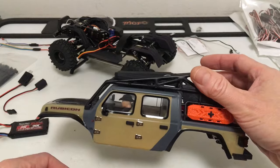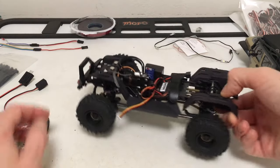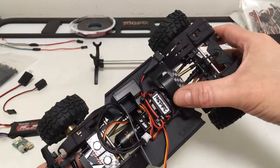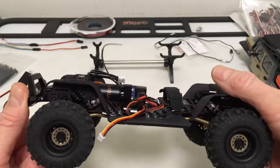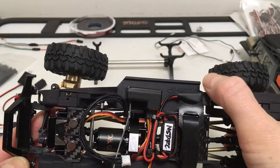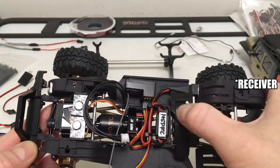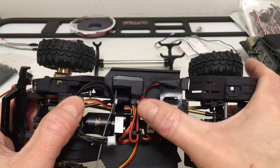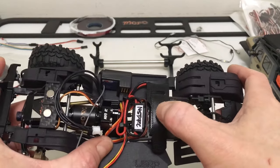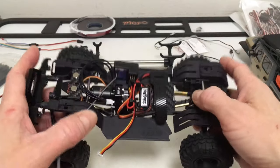So the shell is basically done here. Got to get the rear lights in. So let's look at the chassis so far. I've started in with what I kind of knew. I wanted to get this BEC double-sided down on that little skinny angled cross brace. You can see I doubled back the wires and zip tied them to take up some of that slack. I've got my balance plug there, and then I've got it coming back to the ESC. And then I've got the servo slack, snaked down low, which comes back, wraps around, and plugs in. So it basically takes up all of that slack. And you can see I've got the ESC cable snaked under there. So that's about as far as I've got,